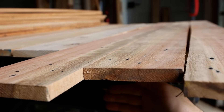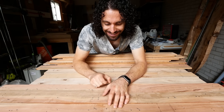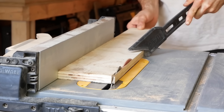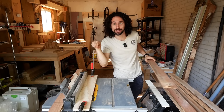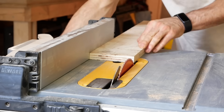It's a lot heavier than a softwood pallet. I think this is going to make a pretty sweet desk. To make my desk, I want to cut these slats into strips. Finding a flat edge on pallet wood is next to impossible, so I need to create a flat edge that I can reference. I don't have a jointer, but I do have this jointing jig that I made for my table saw.